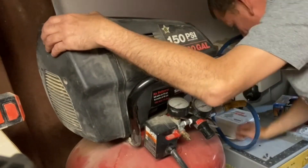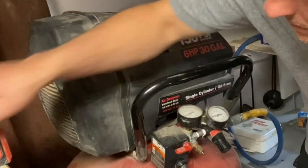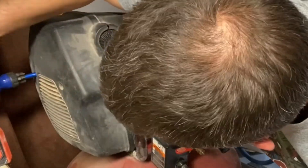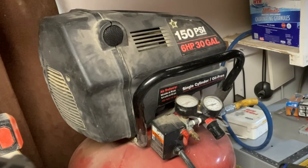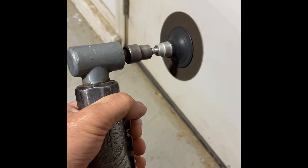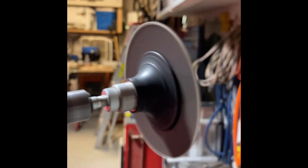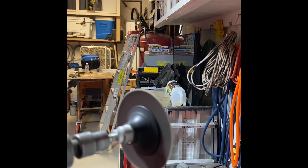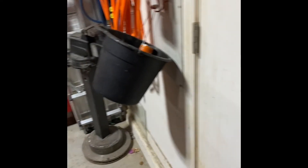You can hear this compressor kick on and it does get up to 150 PSI. I do think it's taking a little longer than it should, and that's because I didn't replace that reed valve plate — if I had it to do over I definitely would have spent the extra money and done it. So hopefully you guys enjoyed this video and it gave you some good information. If so, make sure you hit that like button and subscribe to my channel. The whole concept of my channel is to give you guys the most information in the least amount of time possible, so I don't waste your time. Have a good one, later.